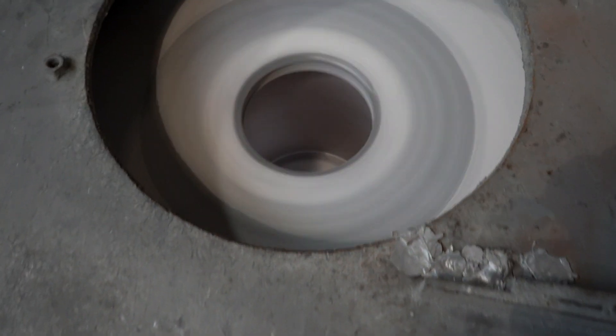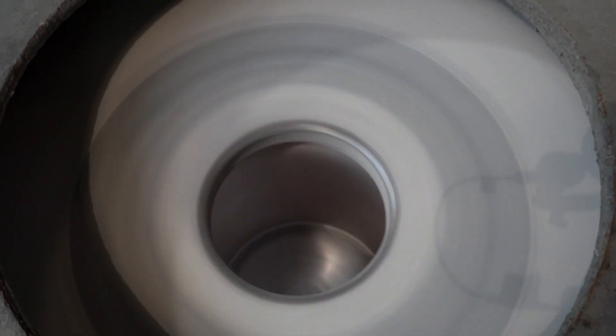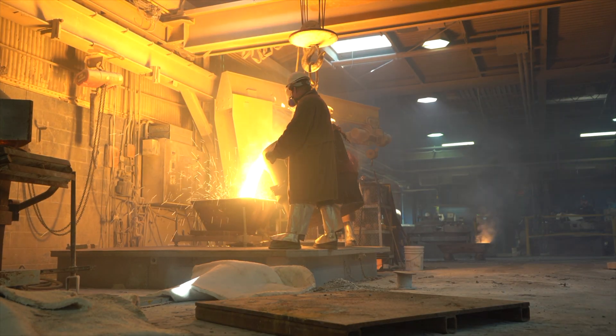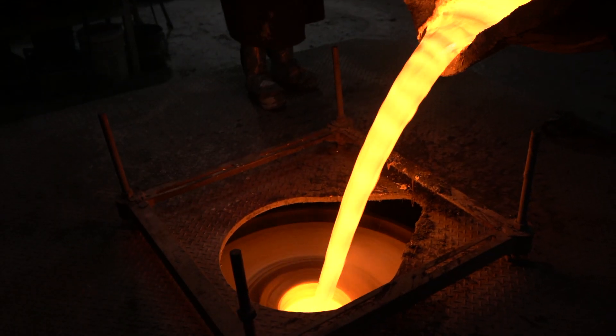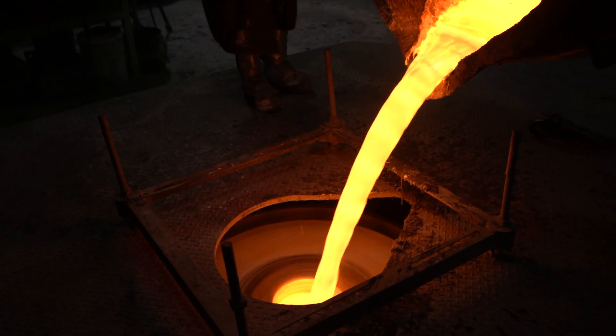The other really cool thing about it is that the die, relative to the metal, is cold — so the metal actually experiences a freezing from the outside, completely uniform towards the inside. That is what allows us to make a really high quality part: no porosity, no shrink, and completely uniform, 360 degrees.